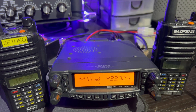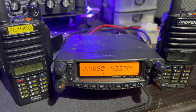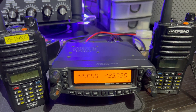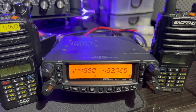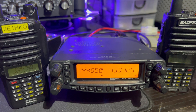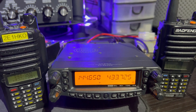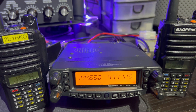I'm doing one in the next couple of weeks, and my station will be a repeater station. Because of the topography of where this event's being held - which is a large city here in the UK - we need a repeater. A lot of the outstations will be on VHF and Control, local stations will be on UHF, and I'll be on some high ground, probably on top of a multi-storey car park, being a talk-through station.